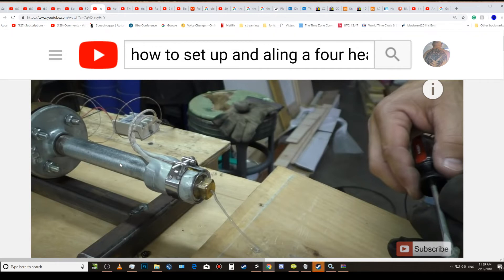He's got this set up like 3D printing, where you put the heat monitor at the very end of the extruder. You don't do that with a filament extruder — the very end of your filament needs time to cool down just a little bit. It's going to take time to move that sensor up and down the shaft to find the right spot. That design of his is actually not bad — it's quite a good little extruder design.